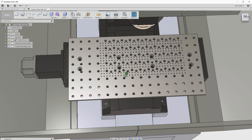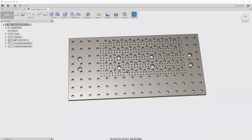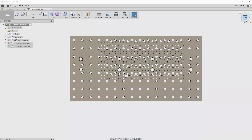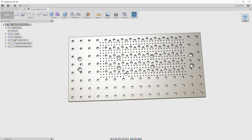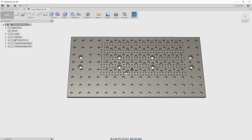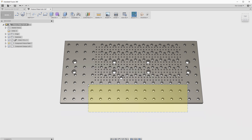I've mentioned in other videos that it doesn't really matter how big a mill you have — you're oftentimes going to find yourself making things that are bigger than your mill. This plate is 24 inches across and 12 inches the other way. It's also a half inch thick, being made out of a piece of cast aluminum so it's flat. But my mill's work envelope is basically where you see the high density. So in order to mill this, we're going to have to do the left half in one operation, the right half in another, the center part in a third, and the remainder of the bottom in a fourth operation. Let's get started.